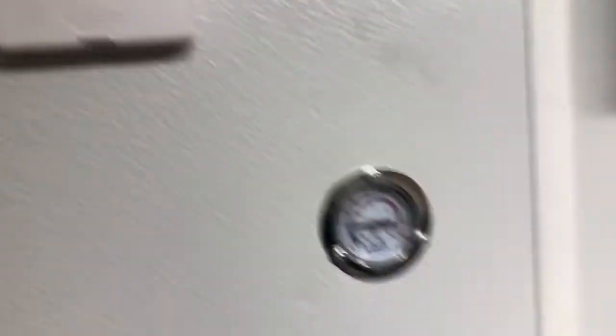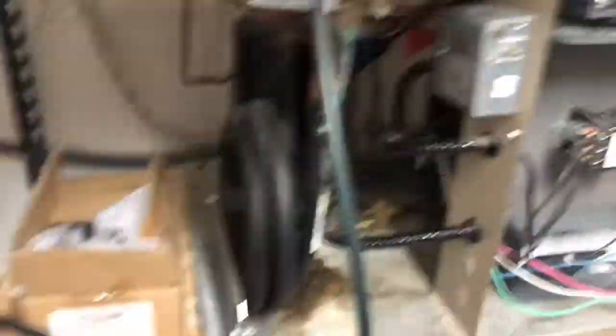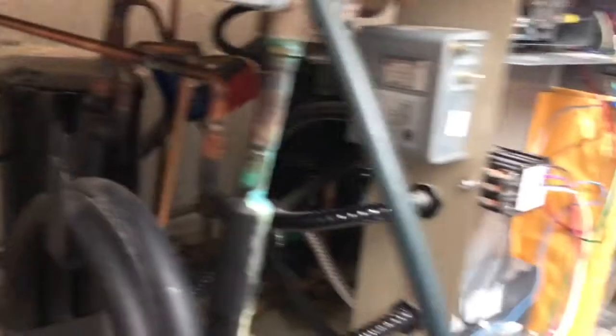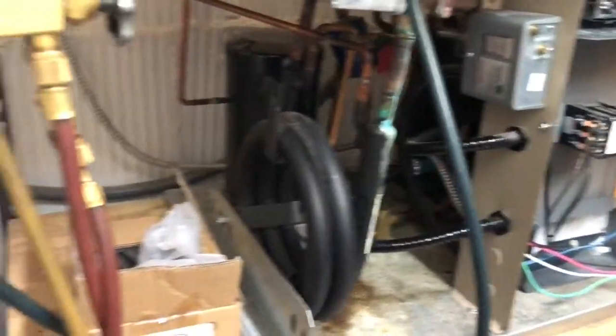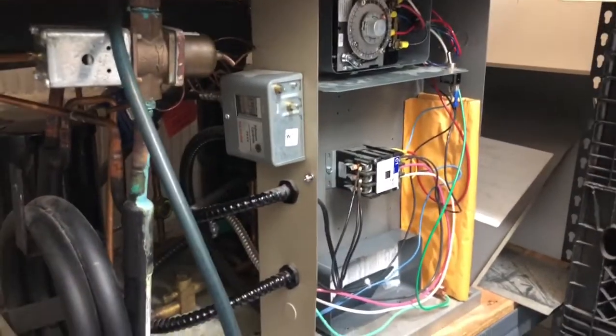So this is the freezer — just a little one, a little ice cream freezer. We're already back down to zero degrees. They only want these around zero to minus five — they don't want the ice cream too hard for scooping. This unit here is actually just pumped out. This is a water-cooled unit, hooked up to their glycol chiller as well that does their ice cream machines upstairs. Very simple, basic unit. There's the one for the cooler above it — the walk-in cooler's over there. Everything's working good, shut off on temp, so we're looking good.